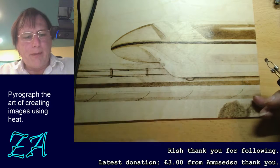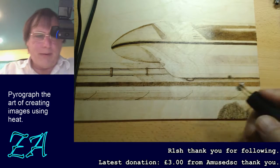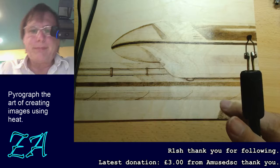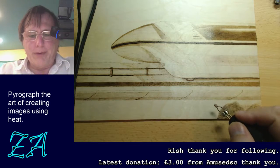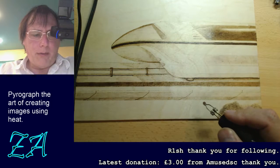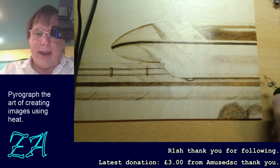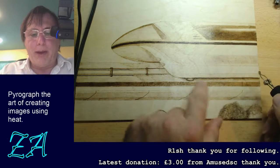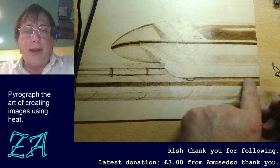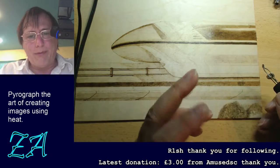One of the most likely mistakes with work like this is that this tool, as I mentioned, is getting hot. When I touch it down to the wood, I'm going to get a darker mark than I would expect. If I want it to do a very light area like this, and I just touch this down now, I'm going to get a dark brown mark, which I don't want because I want it to be light.